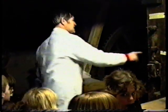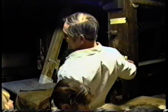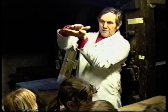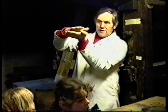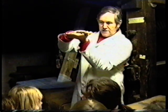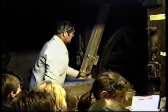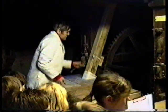It's to do with tentering the gears. There's the word, tentering. By lifting that up and down, we're opening the stone above and making the wheat coarse when it's going round. When we lower it down, it touches it and it grinds it nice and fine, and it turns it into a chute when it comes down into here.